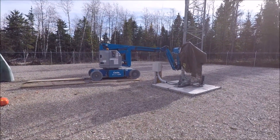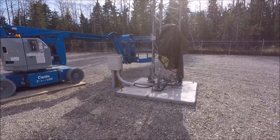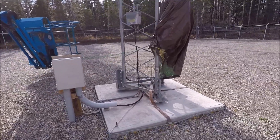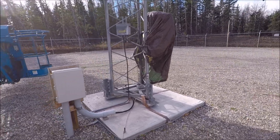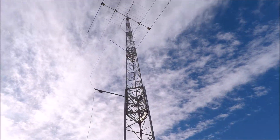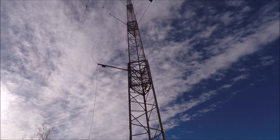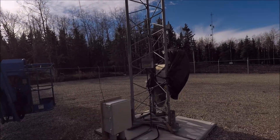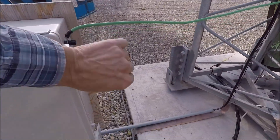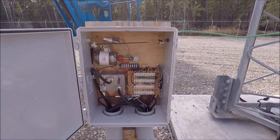I thought I'd do a quick run through on the transmit antenna here for 160 meters at V6WZ. At the remote, the tower is shunt fed and the shunt arm — it's hard to see, we have some sun here right now — is on the second section from the top of the tower. The shunt wire is approximately four feet away from the tower; that's where I got the best match. The matching circuitry is found in the box here at the base of the tower.